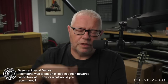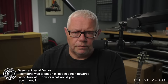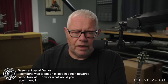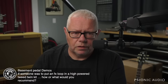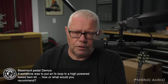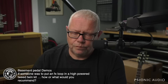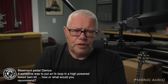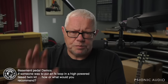Look at the thing I did with Dave Friedman two weeks ago. The technical difficulties, we went over that. There are amps that effects loops aren't great in, and that Tweed Twin is certainly one. There are various options on the market today where you can take the speaker level and send that out to effects and stuff, but I don't think you need to have an effects loop in a Tweed Twin. I think they're at cross purposes.